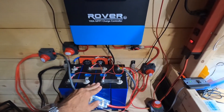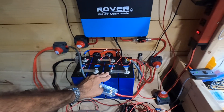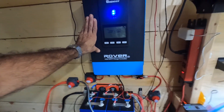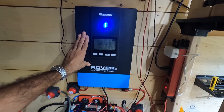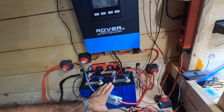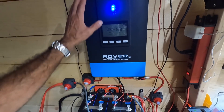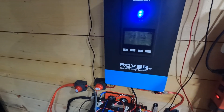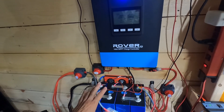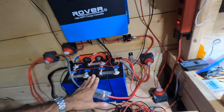Why is that important? Because when these batteries go out, you want them to come back quickly. So far I haven't had an issue with these new solar power upgrades, but in the future I am increasing the amount of batteries I have so that I have more run time even on very dark days. You want to have a fairly good ratio of charging power — which includes your solar panels and charge controller — to actual storage of that power, which is your batteries. So batteries are on the way — they're on a boat.